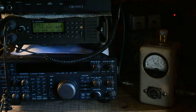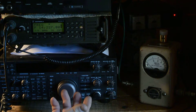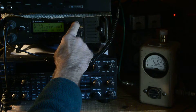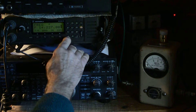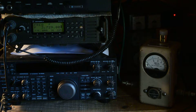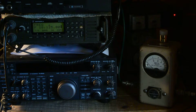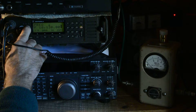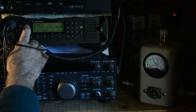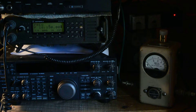So now what we just did was a QSO from Vancouver Island to Georgia. To show another band, all you have to do is punch it in — let's say 3729, enter, and now you're on 80 meters. You have to change the band, go to LSB. Or we could go to 18125, and then use the up and down button to scan the band if you're not doing a fixed frequency.